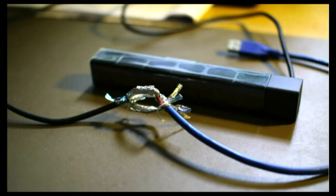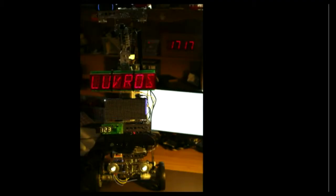Doing stereo vision — instead of just mounting two webcams, I modified one of the PlayStation 4 Eye cameras, which is an interesting exercise because you're cutting a USB 3 cable and re-soldering it, and the signal attenuation on USB 3 is quite fine. On the third attempt it worked. The first attempt, the kernel recognized it, said 'you've got a camera,' I could upload firmware, but then when I asked for a full stream of images it dropped off the USB 3 bus. I think that image says a lot about robotics: if you expect things that are theoretically easy to just work, they'll break in sensational ways. If you see failure and want to walk away, robotics isn't for you — but if you have a smile on your face when it fails, then robotics is for you.